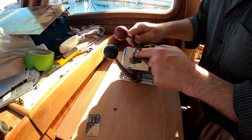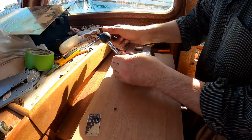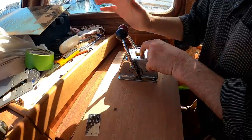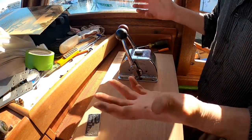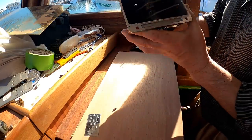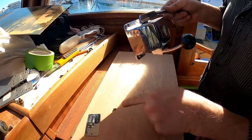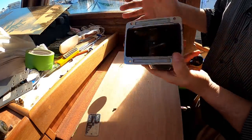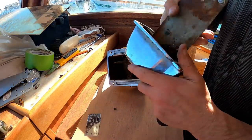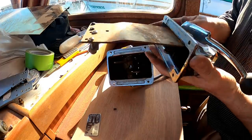There's another thing about Morse levers I only discovered while tinkering. Underneath the nameplate — which is contrary to the way I'm setting it up, showing shift on the right and speed on the left, so I've just flipped it over — there are actually four threaded bosses. Those threaded bosses are to limit the travel of the quadrants inside. The idea being that if you trip and lean on the lever really hard, the limit bolt stops the force from being transmitted through the cable and possibly breaking something — the cable, lever arm, or injection pump. So it's quite crucial these are in play. The problem is they don't line up with the arms on these quadrants.